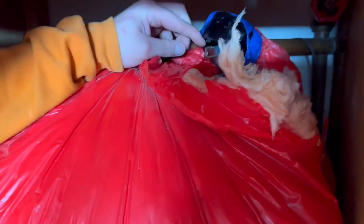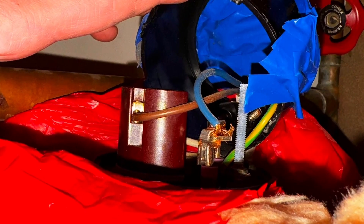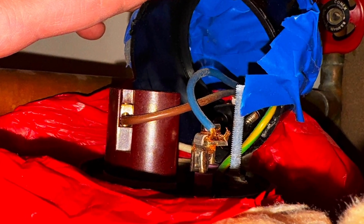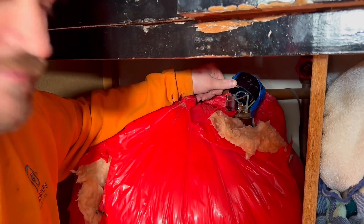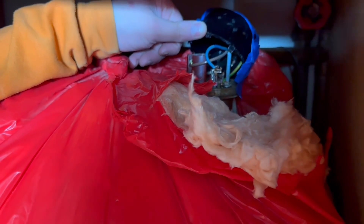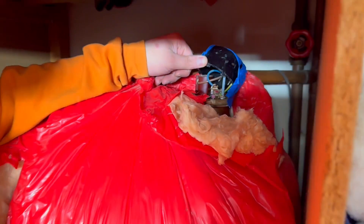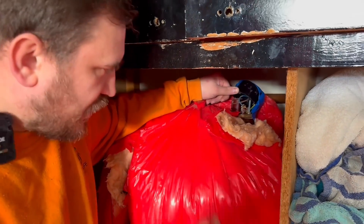It's obviously not on. If I were to come in here, maybe with loose hands and all the rest of it — this is where we want people's comments, because lots of people might go: I can see the blue neutral there on its stud as it goes in, but what's happening to the line conductor? This is where it gets controversial, because lots of people may code this differently — some might code it a C1, some might code it a C2.